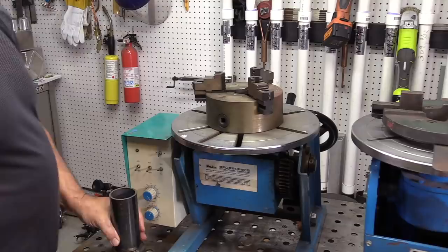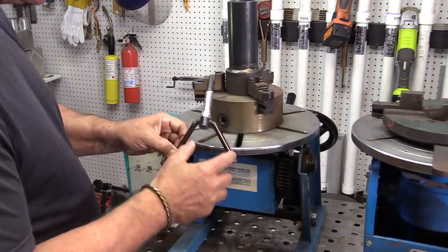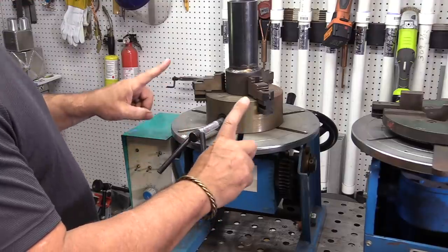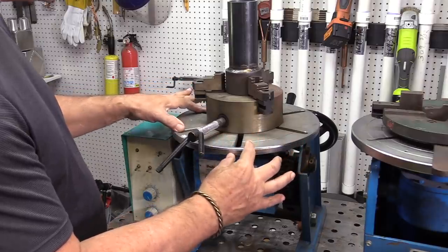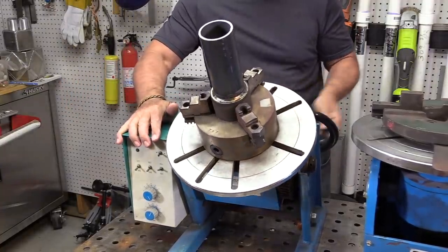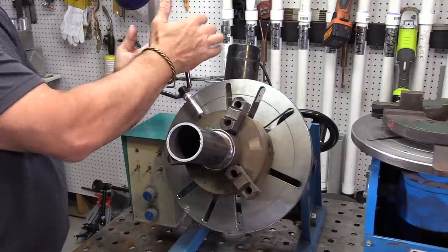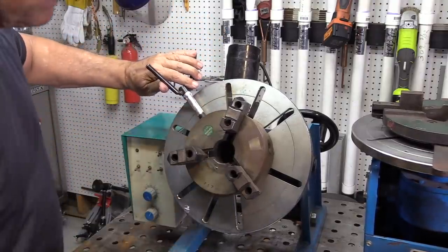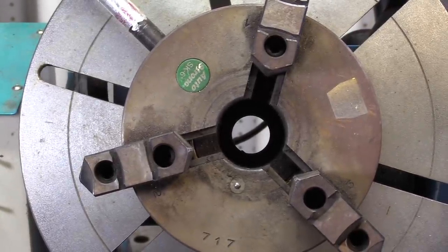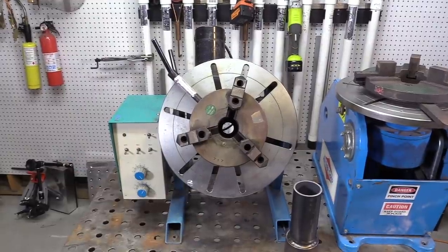Then I'm going to weld some parts with the Cadillac unit today. This first one has a standard three-jaw chuck. I've bent the ears on the key here because it was always in the way. Sometimes you need the turntable for fastening parts, other times you need the chuck. This one also has a little crank so I can set it at any angle I want. And this one has a through-hole, which means I can run a purge hose from the other side — that's a good feature to have.